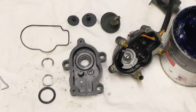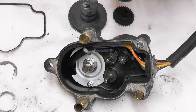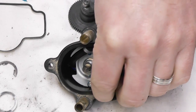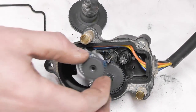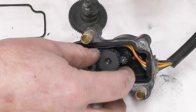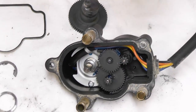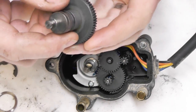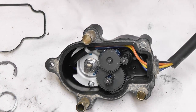Okay, I've got all the parts cleaned up. Now we're going to reinstall — putting grease on the end of my screwdriver and putting on these gears. The big one will go in first, then the smaller one will fit right in here. I'm going to wiggle it around a little bit. Now notice your bigger gear here — it's keyed on the end, and this key will fit right there.